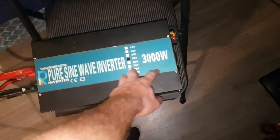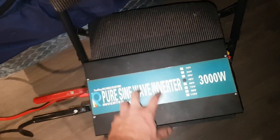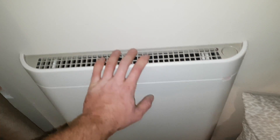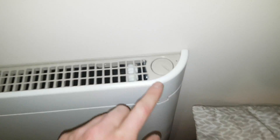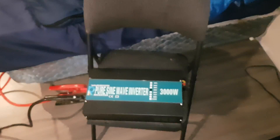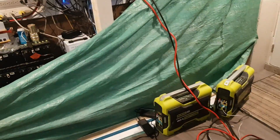This is another one I bought broken — the one you saw in my last video. I repaired it and upgraded it with IGBTs. We'll see if it's an actual upgrade or not. We're starting stress testing beginning with 500 watts — this wall baseboard heater cranked up. Right now the reliable is running everything in this room: the fridge, the heater, the projector, laptop, all the living room stuff.